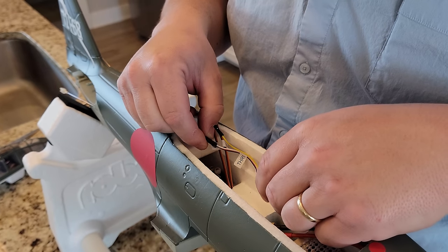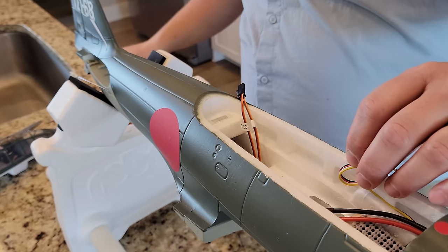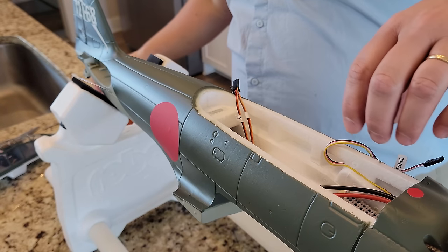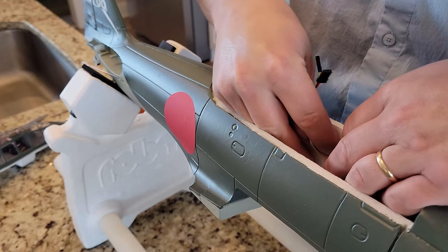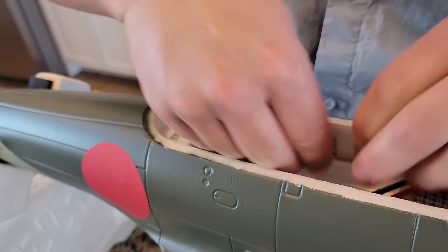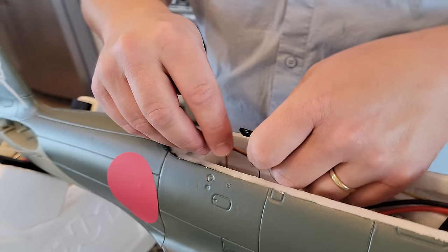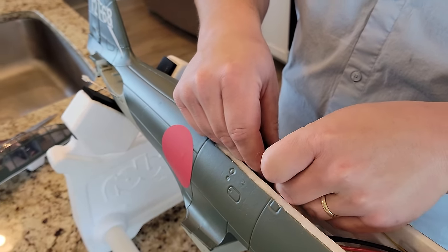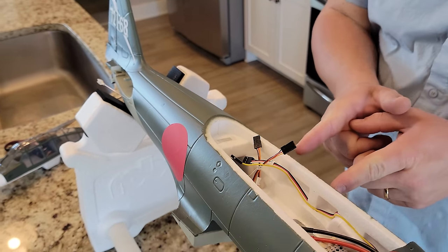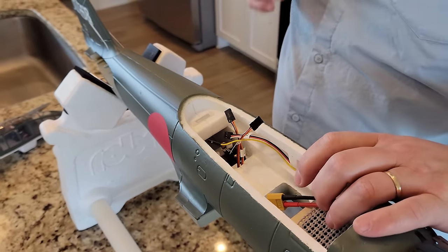I could go one more notch but I don't know if I need to, so I'll do it now — take the big flat screwdriver and just make an opening. Then I can take this cable and slide it into the slot we just created. It'll basically just stay there. Then I can tuck all this stuff down to where the cables are about the same length — very nice, easy to land the cables. Just be mindful of where the canopy dips down.